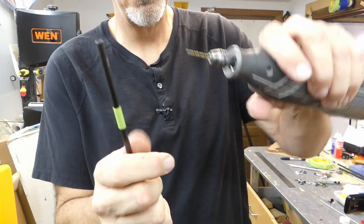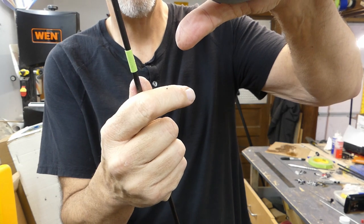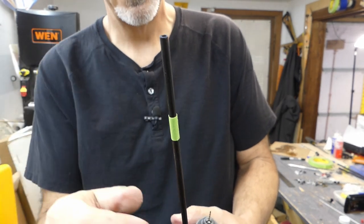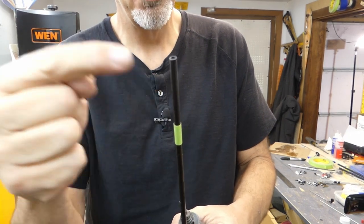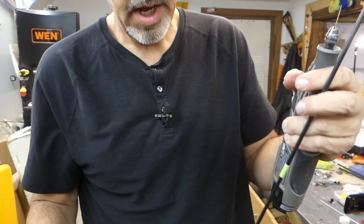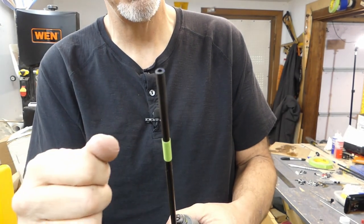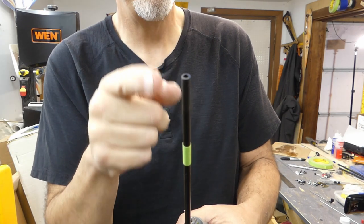The way I'm drilling is just two holes — coming in on this side and 180 degrees up on the other side. That way, once the epoxy comes in, it gets pushed out through the little holes I'm drilling, and that's going to lock everything in place. You can put more holes in here if you wish. I did three on the first one, then went ahead and did two on every other one. I pulled on it when the epoxy was hard inside, and I couldn't get it to pull out — so that's why I had to do a test piece.